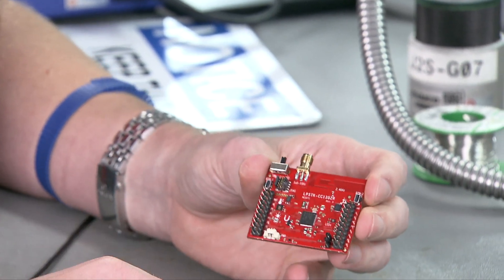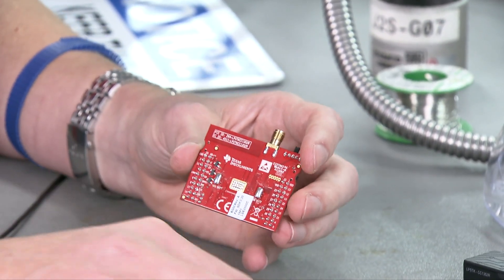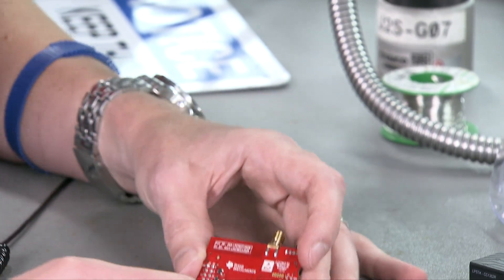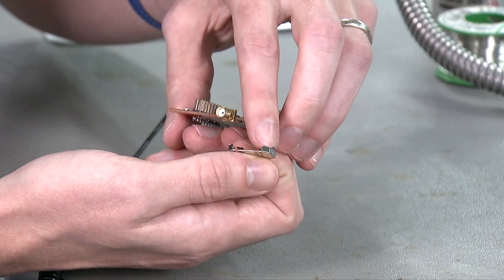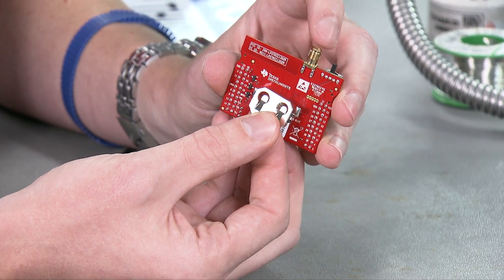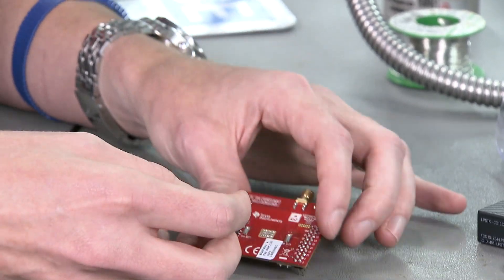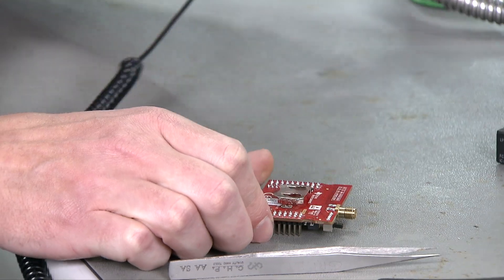Now you have your bare PCB that's ready if you want to add the coin cell battery holder to the back. You can see the pads for the battery holder are here and the connector for the battery is here. You'll want to use your coin cell battery holder that has retaining clips at the top, and place the retaining clips so that it faces towards the antenna so that you can still slide the battery in from underneath and the antenna does not interfere with adding or removing the battery. Set this in place on the PCB.